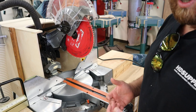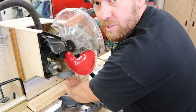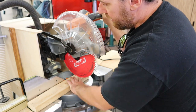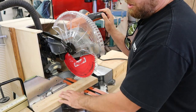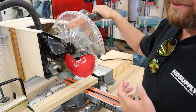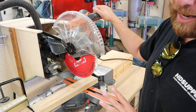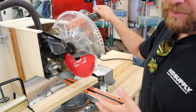In general, when people get hurt on the miter saw, they very rarely just drop the saw blade right into their hand. How do people get hurt? The reason is the same on almost every tool — something called kickback. Kickback can be a very violent, very quick action of the board being thrown across the room, shoved, pulled out of your hands, or dragged. In the wood shop, since we have to push everything into the blades, there's always that possibility.